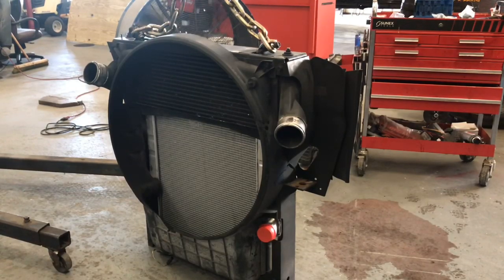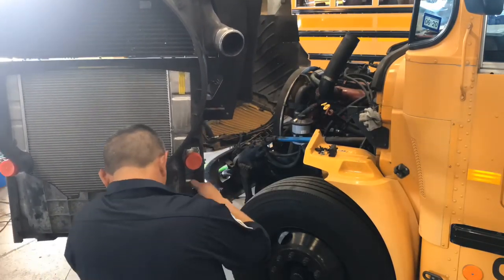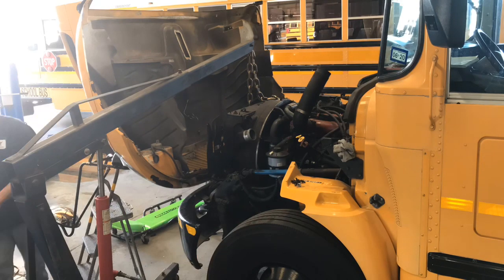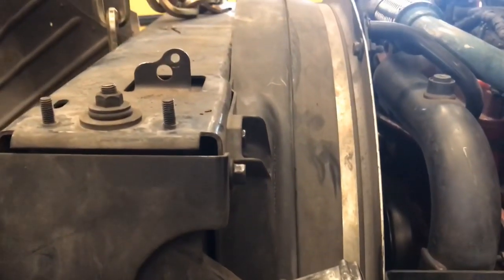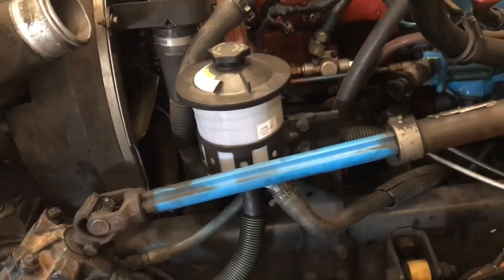The radiator is all assembled — we got the new one back in the cradle, put it back together, now it's time to hoist it back into the unit. The radiator is in. I already put the little mounts and bolts — they're just hand-tight for now — just to make sure it doesn't move. The fan shroud fits right into place. All I've got to do now is get all those hoses on, the cooler lines in front, the reservoir tank, and basically just connect everything back together.